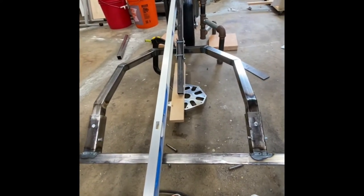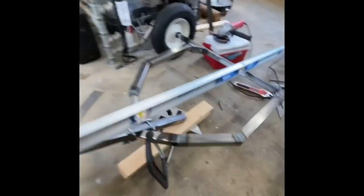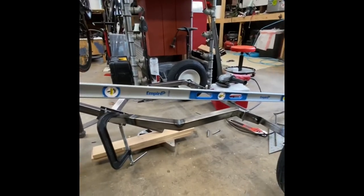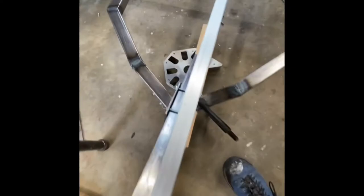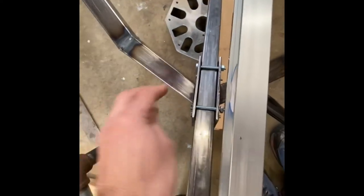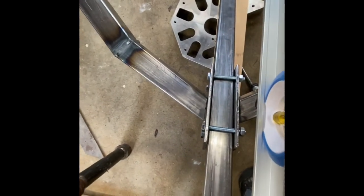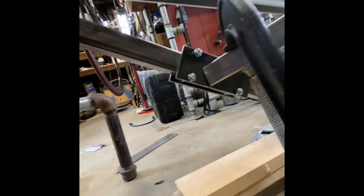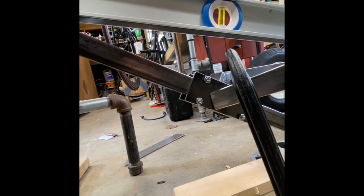So now we need to line up the, throw a tack on these. This is how I want it to sit. I just put the clamp on there to give it a rise. And they fit pretty exact from above. You want these to be lined up since each angle was created exactly equal. And with one, two, three, four, three bends, we're off by maybe an eighth. And height wise, we're off by maybe a quarter, maybe 3/16.